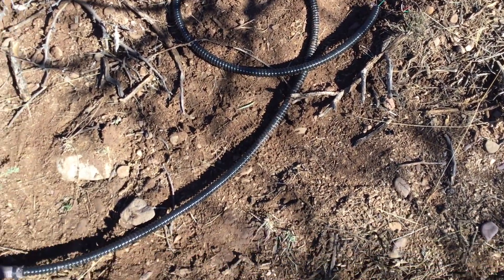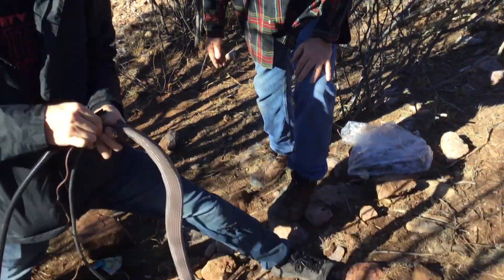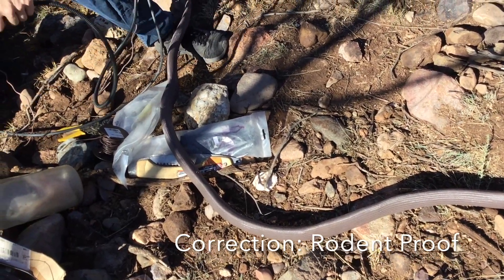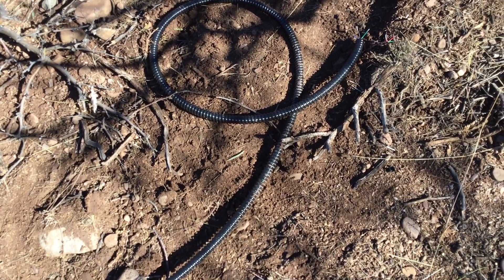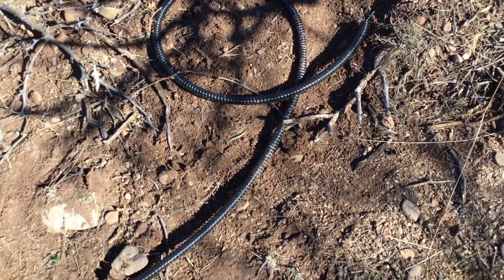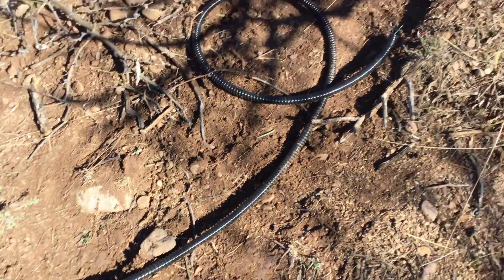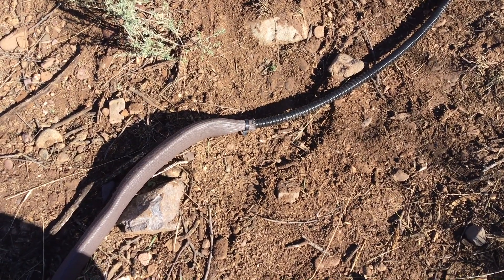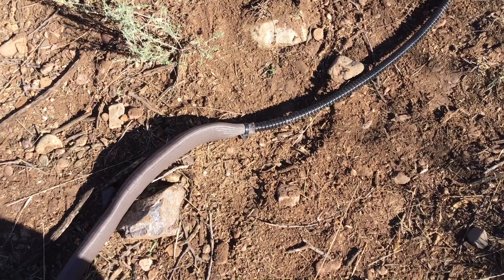There is our conduit with the wire we just described. We are using some rodent-proofing material because we didn't have enough conduit, and frankly it is a little bit easier feeding the wiring through it. Trying to get all that wire through three-quarter inch conduit is a little bit difficult, but we do need conduit to make a watertight fitting with the bottom of the REM. For the last few feet, we put it into conduit with a zip tie so that we can take advantage of the watertight fitting on the bottom of the REM. We can run some caulking right where the rodent-proof material meets the conduit to make a nice watertight seal.